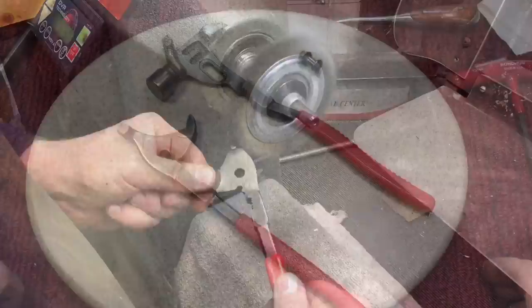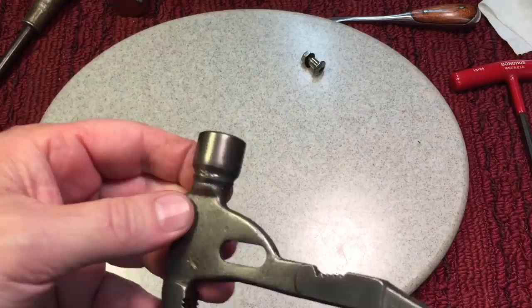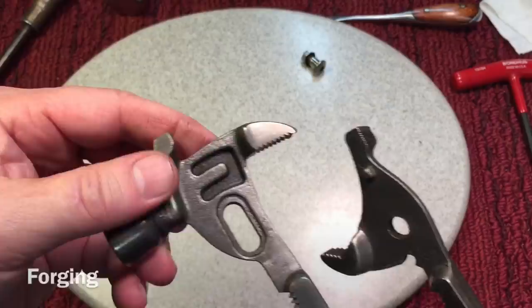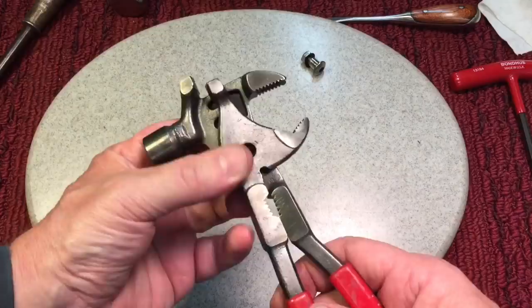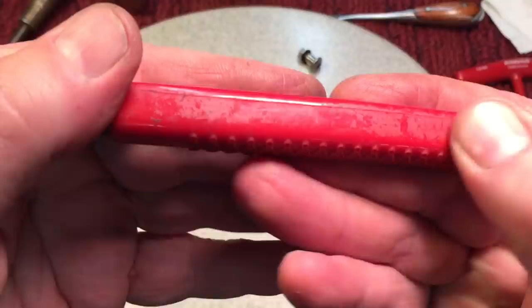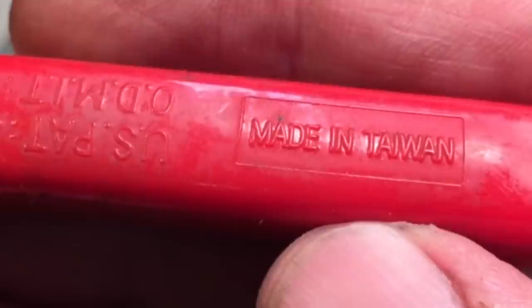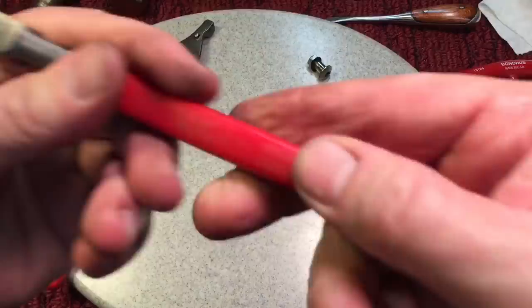Here's our post wire brush evaluation. It definitely is a weld on that hammerhead, but it's a nice weld — they took the time; it's not a spot weld. The teeth are all in good shape, and it's an intricate casting, which means they used fine grain steel. The handles are hard plastic — very quality, almost like the Tenite ones we use. And look at this: made in Taiwan. I knew it. And it's got a U.S. patent on it. Taiwan — they don't make junk.